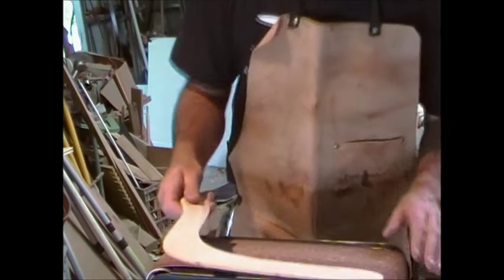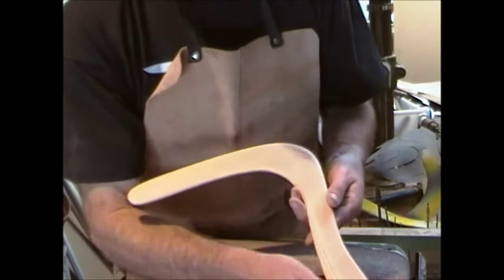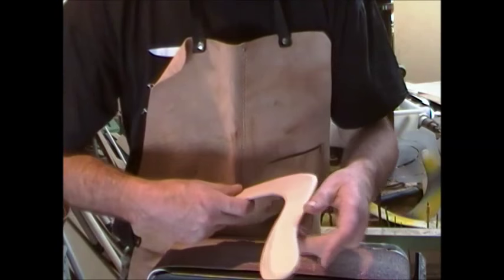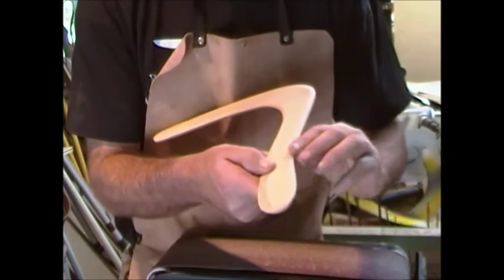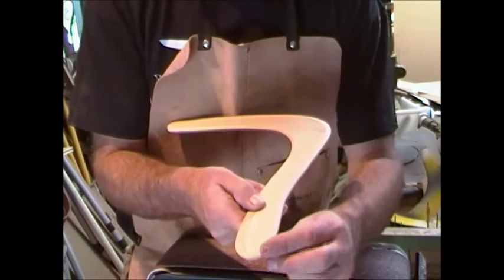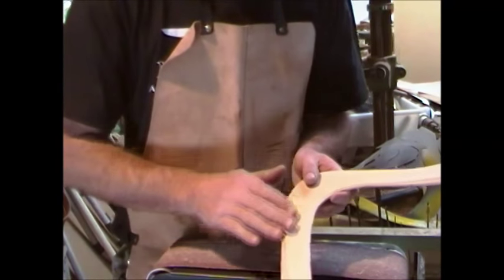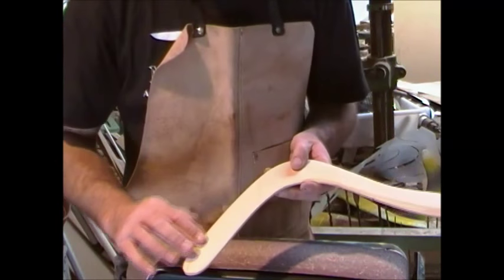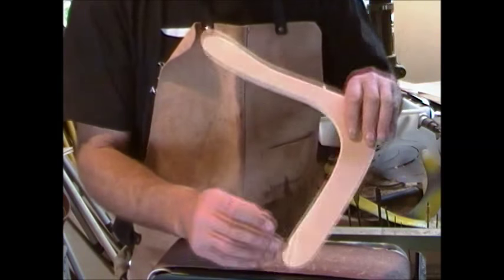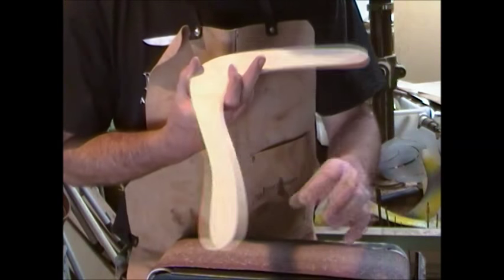And there's my basic shape. So I've got around a 15 degree gradient. I've got a 45 degree sort of bullnose edge on the edge of the lift arm. Same sort of thing happening on the dingle arm, but you can see my dingle arm doesn't have that same curve to it. It's got a slight curve. A little bit of undercut there on the tips of the lift arm and the dingle arm.